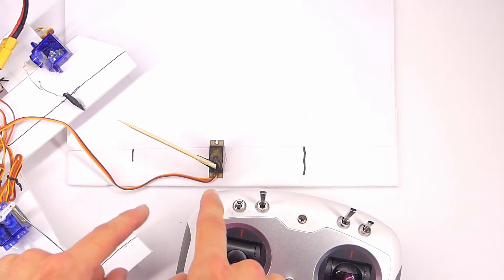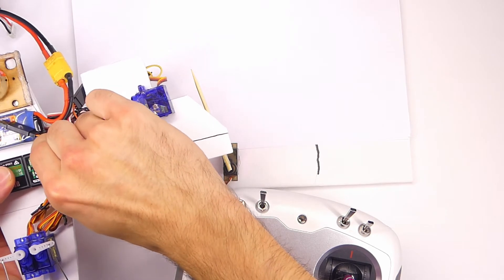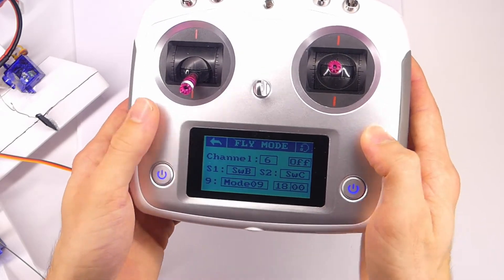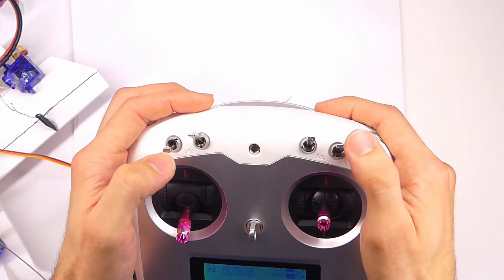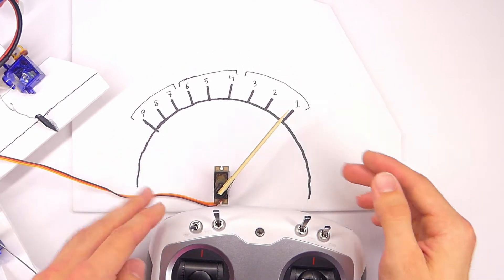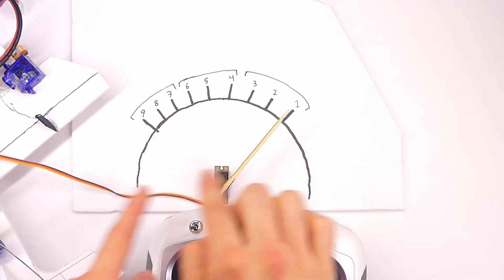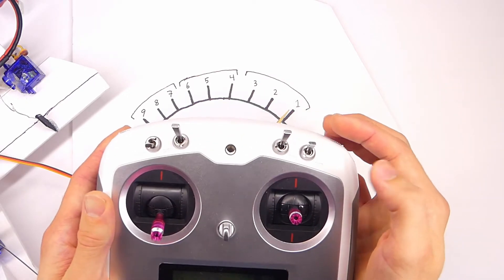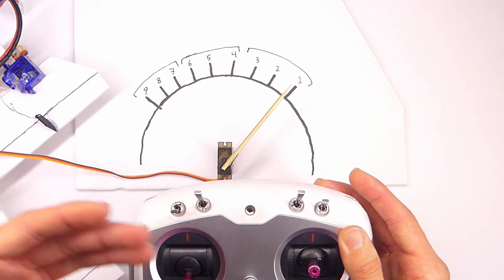Let me hook this up so we can use fly mode with this servo. I have the fly mode feature set on channel six, so I'm going to change the servo to channel six. Now I'm going to go into the transmitter, turn on fly mode — I already have this set up for the demonstration but I'll show you how in a minute. With the switches all the way up, the way I have this set up, I've broken it into nine different positions using a combination of two three-position switches, which gives a total of nine different combinations.